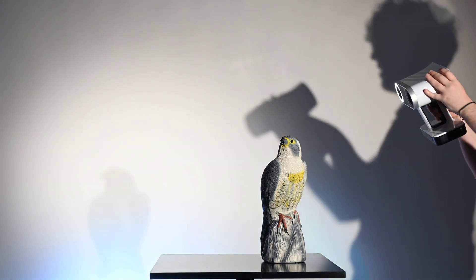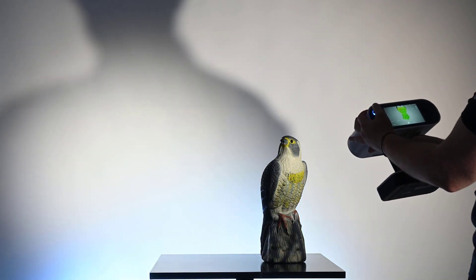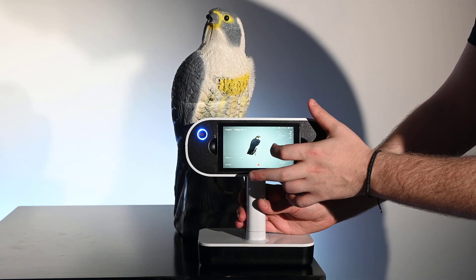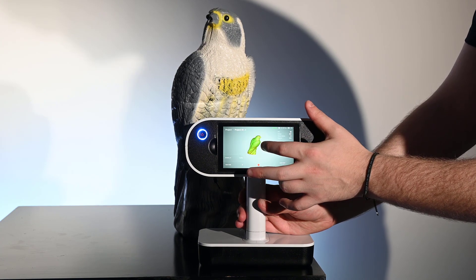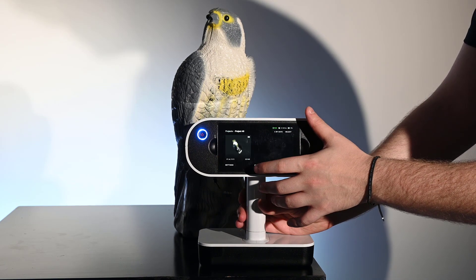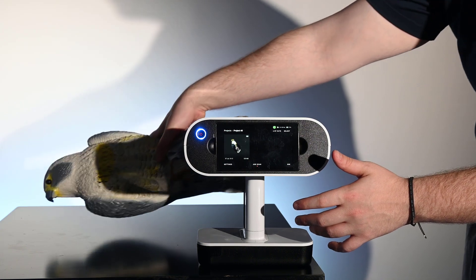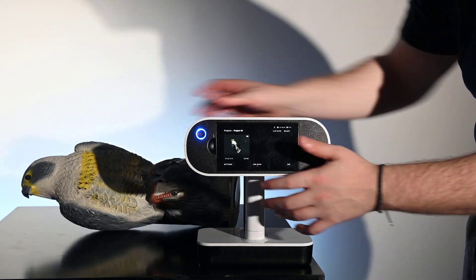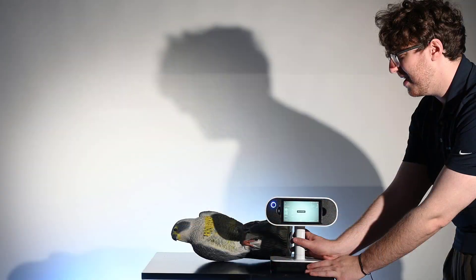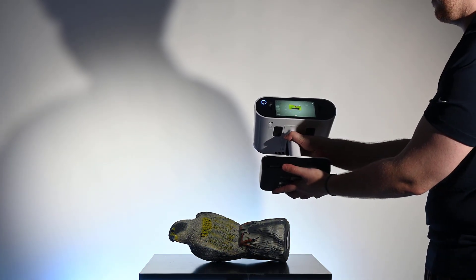You may find yourself toggling between the scan color settings often to check the quality and help with scanning distances. Clicking the red scan button again will stop our scan, showing us a preview of what was captured. The touchscreen lets us rotate the scan around and check if any areas are missing, indicated by red spots on the scan preview, or we can enable the quality setting to see an estimated quality of the scan data. If everything looks good, we can back out of the scan from the top left and reorientate our part to capture a different orientation. Each scan is typically associated to a single orientation of the part, and we can have multiple scans within a project.